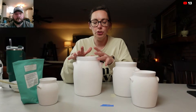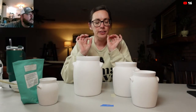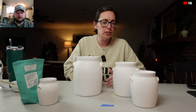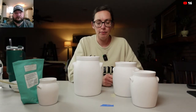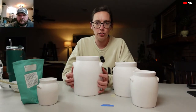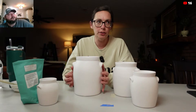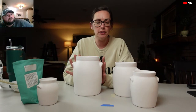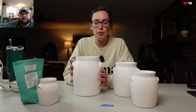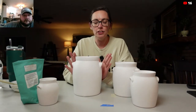I see people paint glass without using a primer. I'll tell you that chalk paint says it'll adhere to anything — there are tons of chalk paints out there and they all say the same thing — but I can tell you they will not stick to glass. There's nothing for the paint to actually adhere to; it'll just scratch or peel off. You have to put some sort of primer that bonds with the surface in order for your paint to stick.